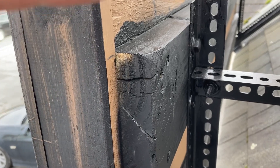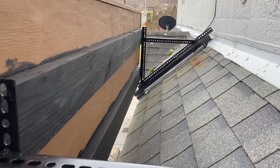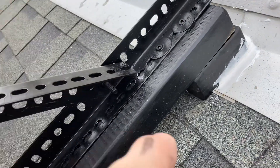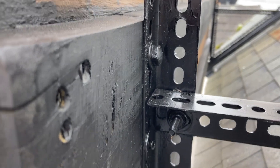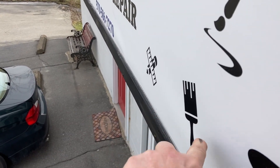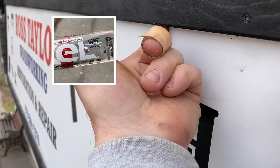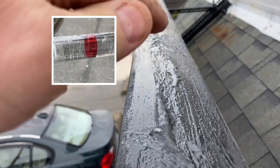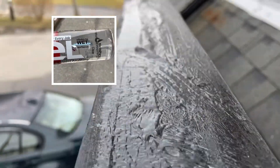All you do is lift the sign up the ladder, lift it up, and hook it onto the rail — that held it in place while I got it leveled up, and then I permanently attached the rails. I added some extra screws: one 3-inch screw down through the black block, which is bolted to the roof, and got those lag bolts into the rails, so it's not going anywhere — nice and rigid and solid. Down along the front I was a little concerned about water getting behind the rail, so I put a clear sealant there and up the edge. I didn't seal the bottom so it can breathe. I brushed a coat of clear sealant across the top, and I might go over it with one more pass.